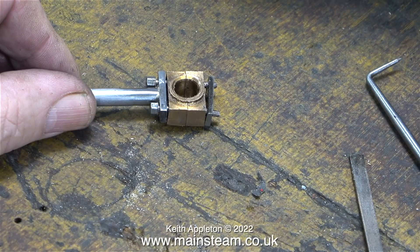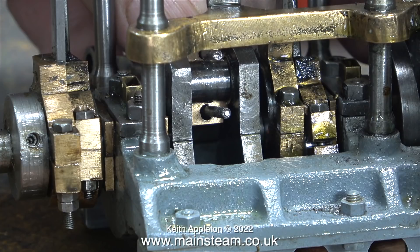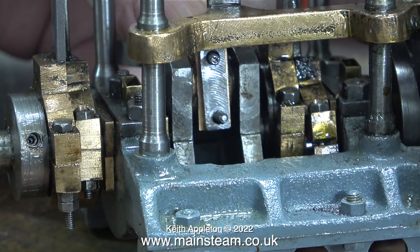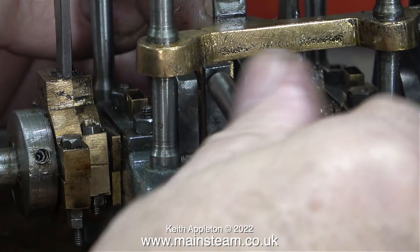Here is the new part fitted to the old parts — it's time now for a bit of reassembly. This was a very fiddly job. In this clip you can see that one of the holes in the big end brasses is bigger, but this really doesn't matter at all because the big end brasses can't go anywhere due to the two crank webs either side of them. Here I'm fitting the bottom part, which is a steel plate that will hold the pair of gun metal brasses together.